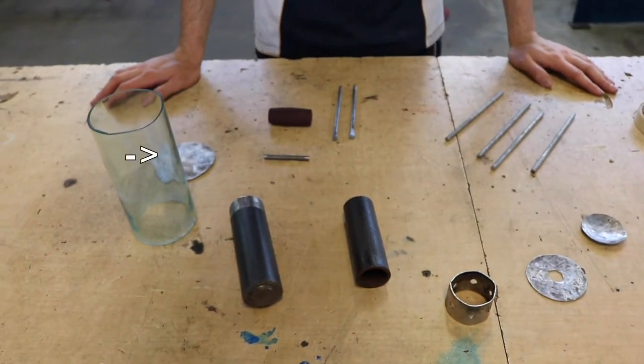Today I'm going to be making an oil lamp out of what you see basically in front of you. Behind this glass is an 80 millimeter diameter circle cut from a piece of mild steel sheet metal. A short section of 45 millimeter round stock used for making the top cap. 35 millimeter diameter pipe cut to 100 millimeters. A strip of mild steel 30 millimeters high and 125 millimeters long with 8 and 5 millimeter holes drilled into it and shaped into a circle 40 millimeters in diameter. A 68 millimeter circle with a 13 millimeter hole in the center. A 45 millimeter circle domed with a ball-peen hammer. A 6.5 millimeter diameter rod 60 millimeters long. Two 6.5 millimeter diameter rods 130 millimeters long with 15 millimeters of one end flattened. And four lengths 155 millimeters long cut from the same 6.5 millimeter diameter rod.